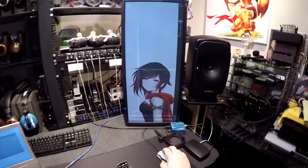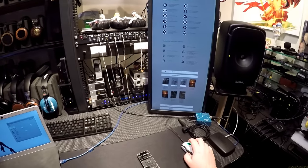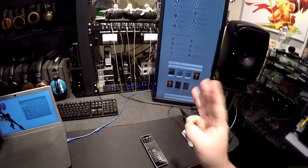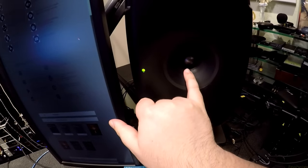Okay. So let's look at some specs first of the 8341s. They weigh 22 pounds each. The woofers, plural, because this is a three-way on each side, have 250 watts to run them. The mid-range, which is this inner part of the cone there, just like a KEF would have, a coaxial, gets 150 watts. And the tweeter in there, a little baby three-quarter inch tweeter, gets 150 watts.